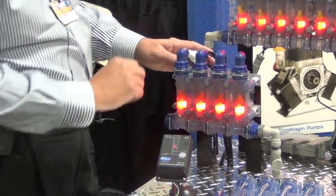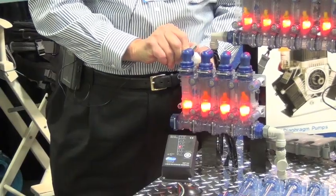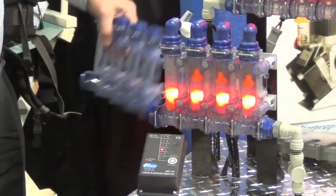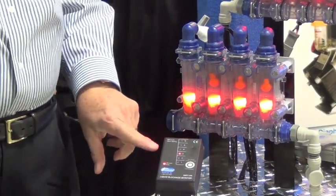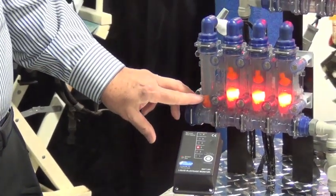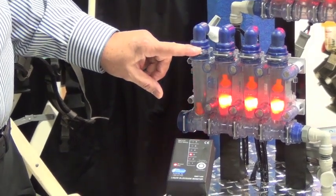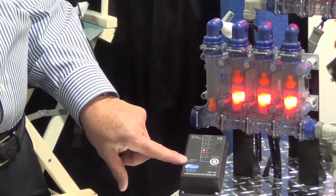Okay, there's three. This is a little valve, and I'm going to turn it off. When we turn it off, you're going to see that the flow has dropped. There's a slight delay. After the delay, in the back you're going to get a flashing on the actual line that is blocked or has a low rate. You're going to get a warning signal in the cab.